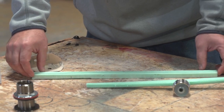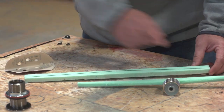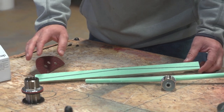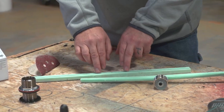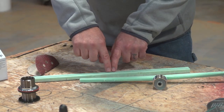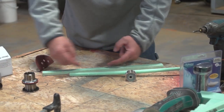Now next, you can see here we've drawn on this foam the angle we're going to take, and all we did there is just cut that out. You can take your sandpaper and kind of sand that if you're trying to shape it a little bit more, but really this won't be seen that much unless you're actually looking inside the sink. The reason it's beveled like this at an angle is because the water then all runs down to the center.